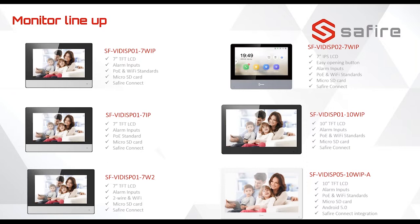The first monitor has Wi-Fi and IP. By the way, all models are powered over Ethernet except the two-wire one. The second monitor is IP only — no Wi-Fi. Why are there two models? It's simple: if you have a large apartment complex and the main building doesn't have internet access but you want call forwarding to your mobile, that's where you need the Wi-Fi connection.